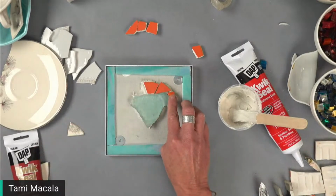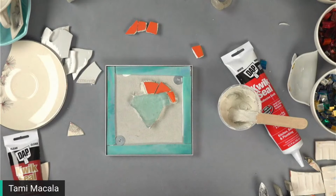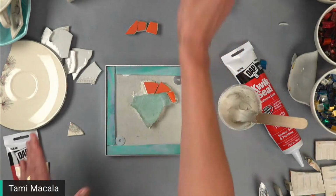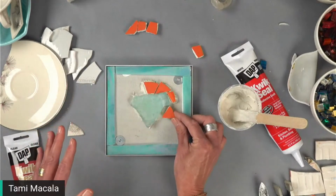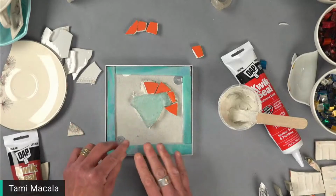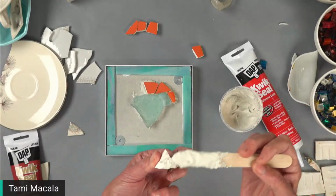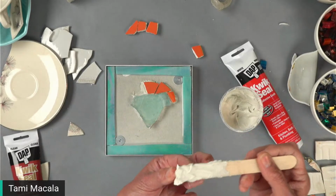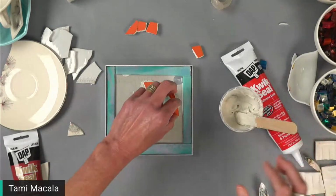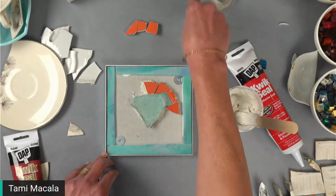And a lot of times there's a thing called dry laying. When you apply your mosaic without the adhesive and you just dry lay it out, it'll be one shape. Then you'll go to lay it with the adhesive or thin set, and it won't be the same. It never, ever happens the same, and I'm not sure why. I would have to study that a little bit more, but it just doesn't happen.